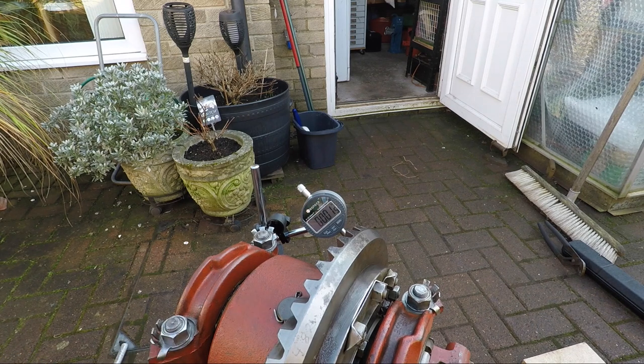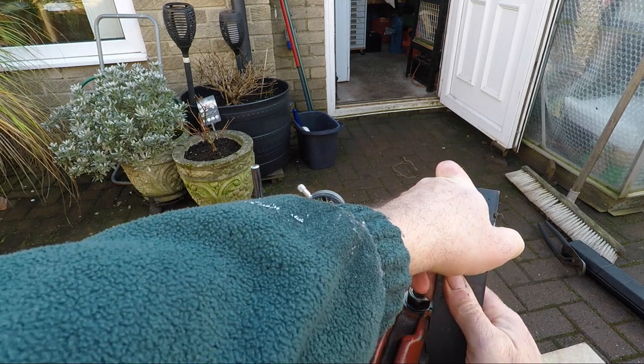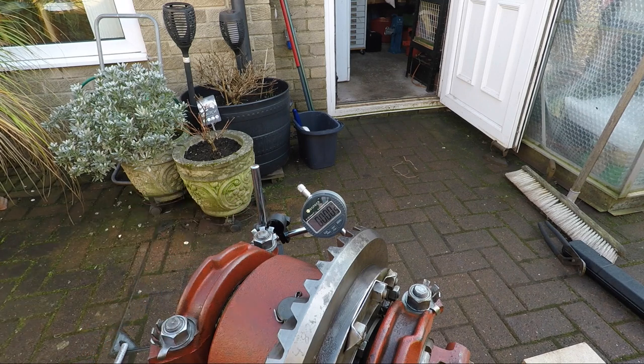One more. One more. Zero o'clock. That's the worst thing with these. Half a thou. 8, 1.5. 8.5. 8.5. So we're looking at about 8 thou there. Between 7 and 9 was backlash.